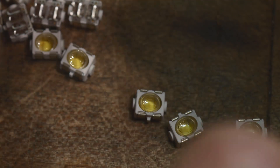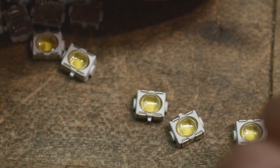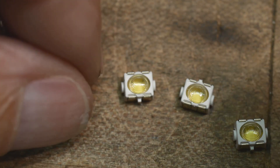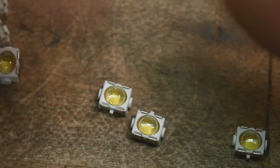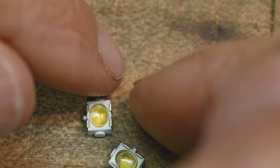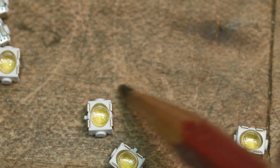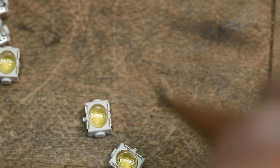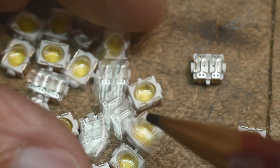What pattern would that be? Well, you really want to project a rectangle into space - you're going to take a picture that's a rectangle, so you want light that's the same shape as that rectangle, because any light outside that rectangle is wasted. To be very efficient, you want this to match the cone angle of the lens in the cell phone camera. The lens designer will need to fit a particular shape and particular brightness levels - center brightness is specified. There might be a spec at maybe 70% to the corner, horizontal specs, vertical specs, and a uniformity spec. It can't just have holes in it - it has to be uniform to a certain amount.